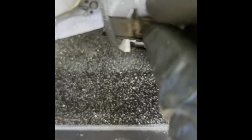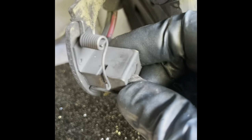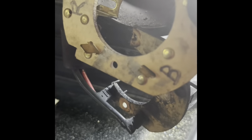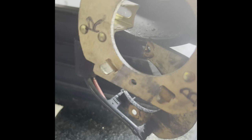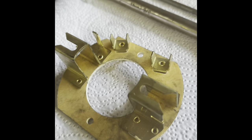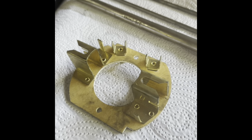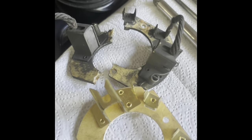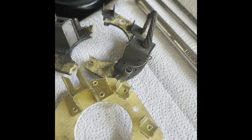I released the spring up onto the stay notch right here, and it's still not moving very well — some debris got in there and clogged it. Go ahead and mark your lines, match it up to your other brush plate. I marked black on one side, red on the other. There's the new brush plate — quite a bit of difference. The old brushes are all stuck open. I'm surprised this thing even ran. It did run — it was just really noisy.